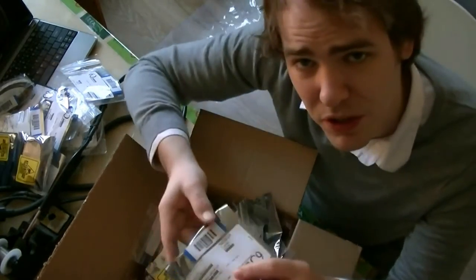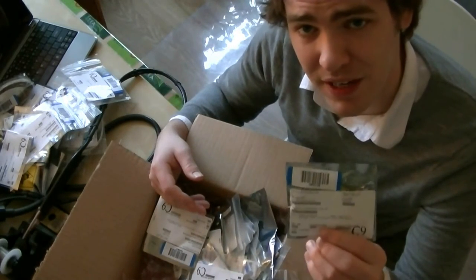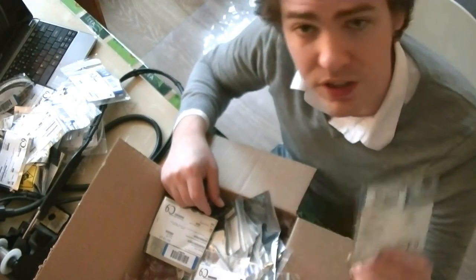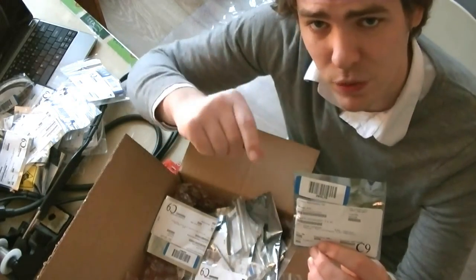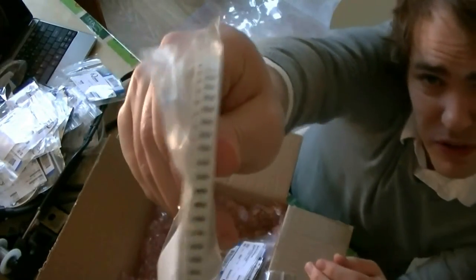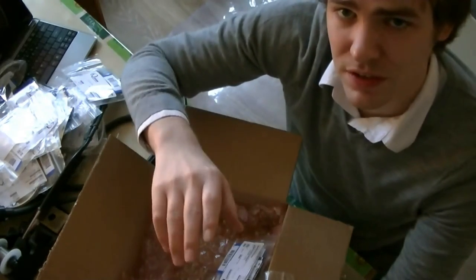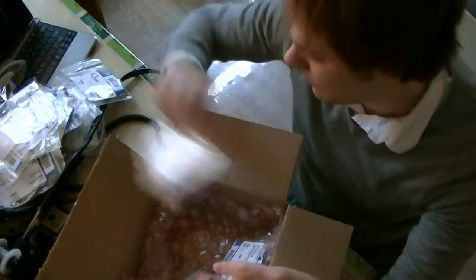Here's some stuff that we don't usually stock — these are the triacs and power-switching components for the soldering iron driver. We tried to buy these by the reel but couldn't get anybody to quote us a cheap enough price. This is a 3.3 volt regulator in a tiny SOT-223 or SOT-23-5 package that we use on the Bus Pirate, the Logic Sniffer, and most of our stuff. It's a little 3 volt regulator where one pin is a switch so you can turn it on or off. These resistor arrays are something that's hard to find — people always have trouble sourcing them. There are four resistors packed into one, and we're using them increasingly because it's cheaper and easier for the producer to place one resistor array instead of four individual resistors. If you have trouble finding them, they're on our parts list wiki linked in the post below.